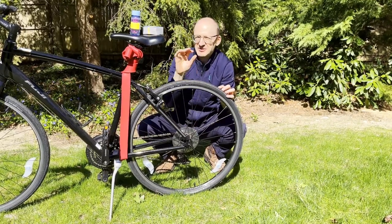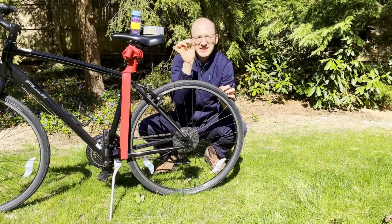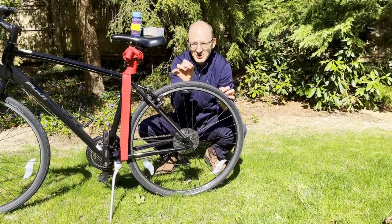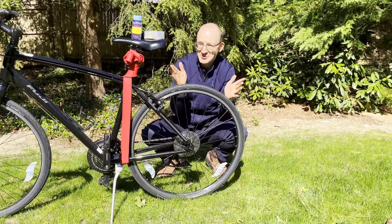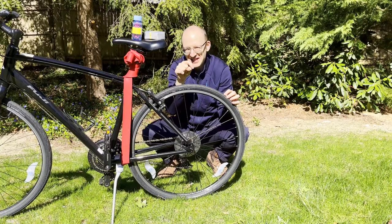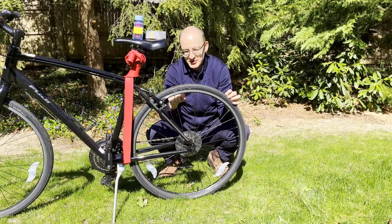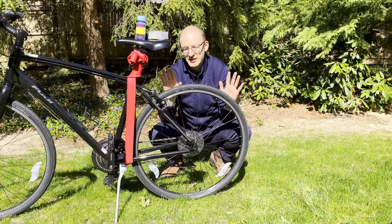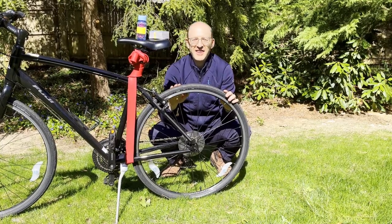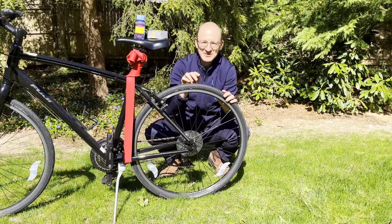So there we go — three things about bicycles: spokes in pre-tension so they never go into compression, balanced by a compressive circular rim, which is great because it's a wheel. And third, that those spokes are just slightly off-radial so that you can take the torsion loads at the hub tangentially into the rim. And that is why bicycle wheels are so clever.